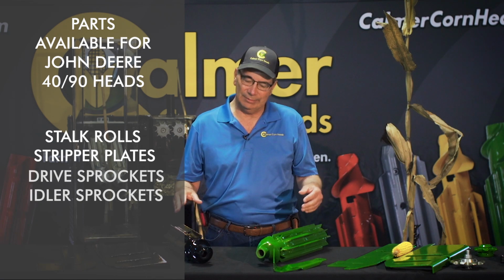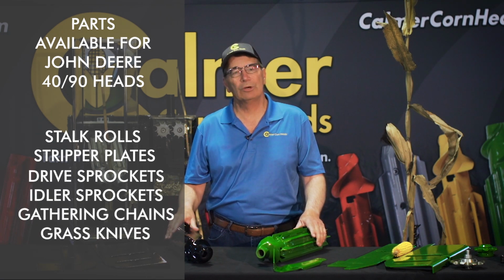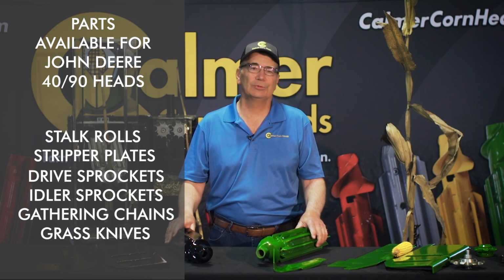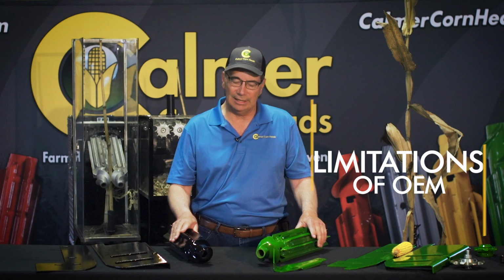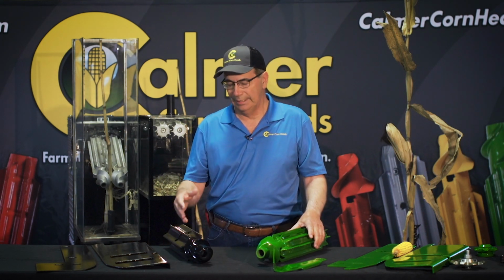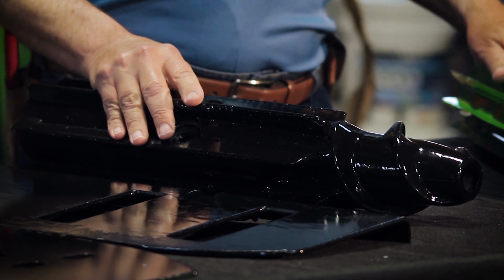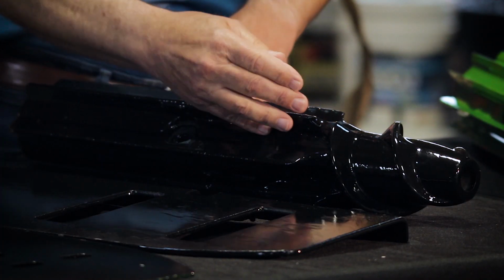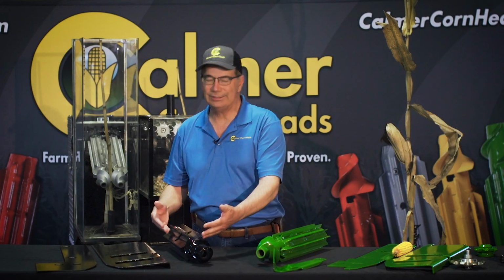So the original equipment worked really well back in the 70s and the 80s and 90s when these corn heads were popular, but the limitation of the existing cast rolls that were on the 40s or the 90s was the overlapping flutes. When they spin at high speeds, they create basically a solid wall of rotating steel. And I think we've all looked at these OEM stock rolls and you notice the first inch wears, but the rest of it looks like brand new. And that's a good indication that's telling us that that theory is correct.